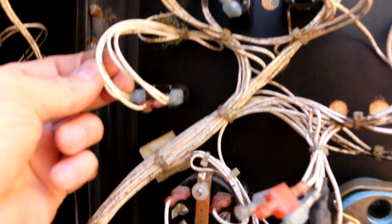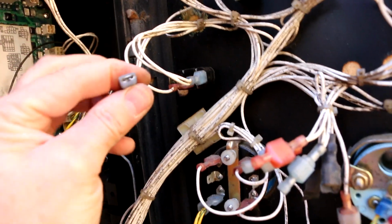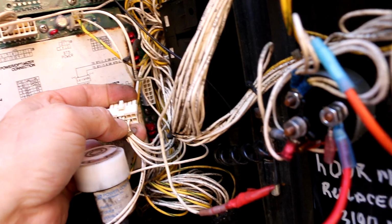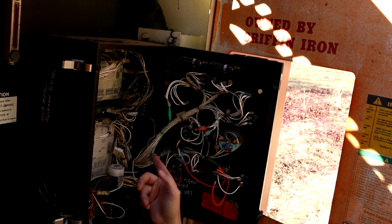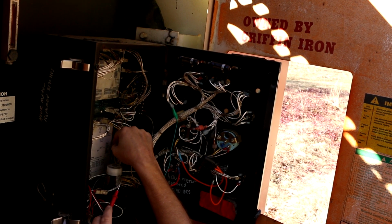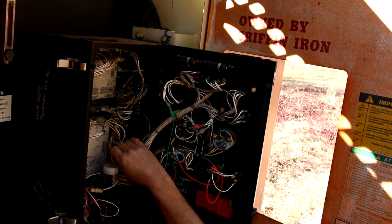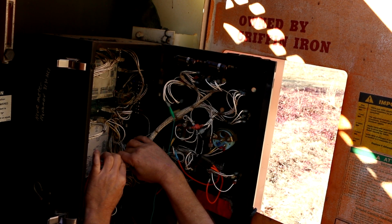And then it comes out of the toggle switch and eventually goes down to that C connector. So all I need to do is pull this off here, and I want to check continuity between here and that pin right there, and I should have continuity. So I've got this wire disconnected from the toggle switch. I've got my jumper wire clipped to that, to my meter. Got my meter set to continuity. Now if I just come here to this plug and I go on that pin, which is pin 18, I have 0 ohms, so I have good continuity there. So unfortunately for me, just checking the actual resistance of that, yeah, it's 0 ohms.